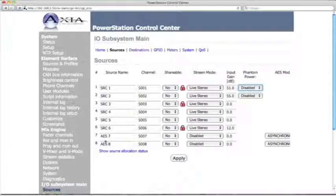We also have a couple of AES inputs — if you have devices with an AES digital feed, you can bring them in right there. First, let's call our microphone 'Mic 1'. Go up to source number one, since that's where it's physically plugged in, and change the name to 'Mic 1'. For the channel number, I have a little scheme: I take the last octet of the IP address of the device — so it's .2.50 — and make my channel numbers all start with 50, then go 01 through 08. That way I don't have a duplicate channel number anywhere in the system. Leave the shareable setting at no for backward compatibility, and the stream mode should be live stereo. The input gain for that mic — I tested it already and 51 dB is just about right.